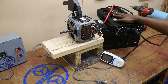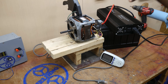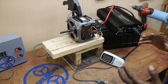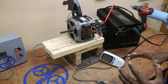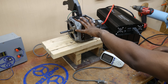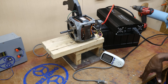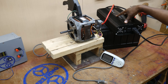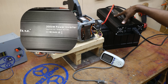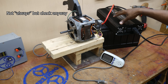That's what we have here — an inverter. These are usually designed to go from 12 volts to 120 volts here in the U.S., or 240 in other countries. The key here is you need a really large inverter. When the motor starts, there's a large surge of current. When you step on the accelerator, the car is still and the motor is producing its maximum torque, so you're going to have the highest current coming from your inverter. This particular inverter is a 3,000-watt inverter — at least that's the claim. Sometimes they outright lie about that number, but if you read the reviews, there's always somebody who's tested it.